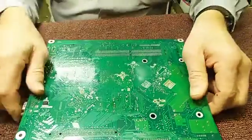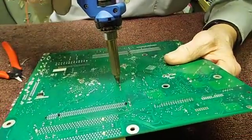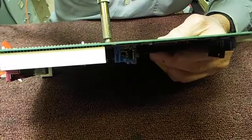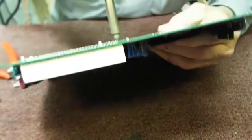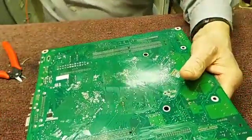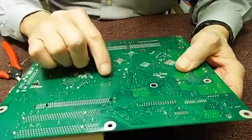Turn on the little noise machine over there. Now that the cap is out of there, I can go to the hole, heat it up pretty good, and then suck the hole a little clean — so that hole's clean. And then the one we used with the solder wick, make sure that hole's clean too. So there are two ways: the solder wick worked but took quite a while, and you had to reheat it and take it out. The solder sucker worked — worked nicely.